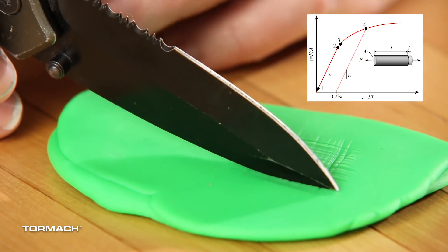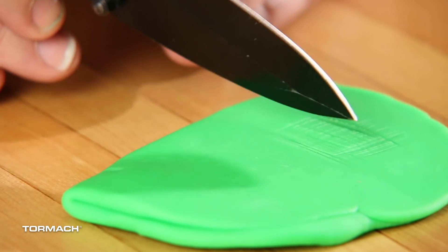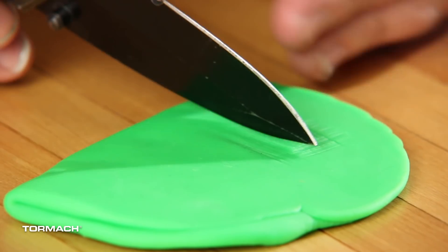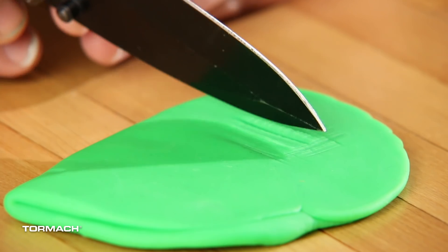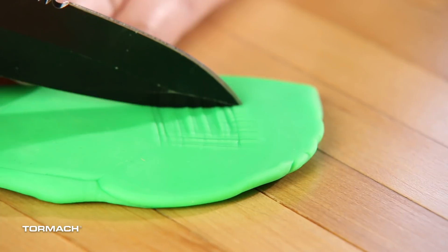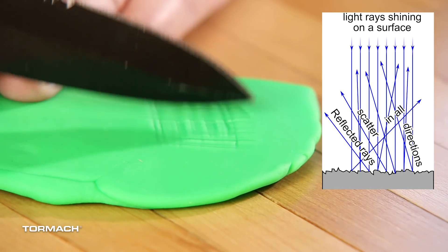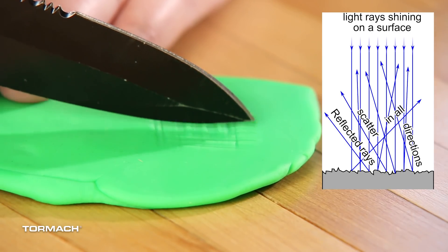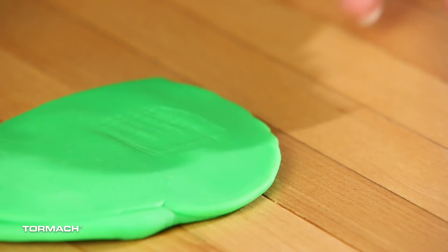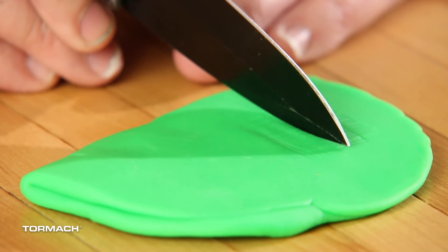Metal itself actually has a yield point, and you don't want to go past the yield point. Right now we're going nice and light. So as you go, the material is going to move forward a little bit, but it's going to go back to its original position. And eventually you're going to go finer and finer until you're left with this really nice smooth mirror surface. There's nowhere for the light to get trapped down inside those scratches. You're stoning out anything that can trap light, and eventually you're bringing that polish up so that there's nowhere for it to go, getting finer and finer.